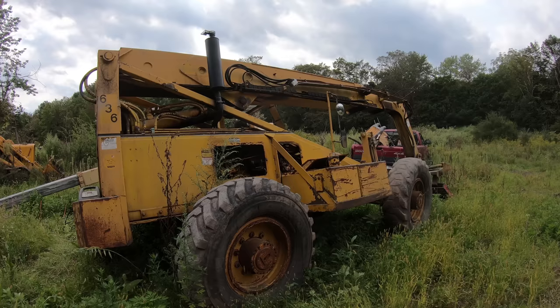So what I think I figured out is that it's not getting power and maybe not even ground. These three wires are unhooked. I'm thinking that this is the power when you turn the accessory switch on, which is the ignition. And then this should have ground, but let's just try putting the power to it and see. I just got power going right to the ignition here. Got a jumper wire.